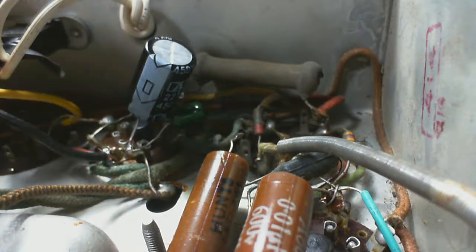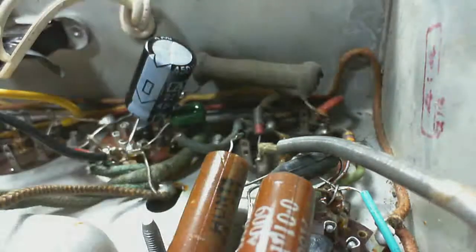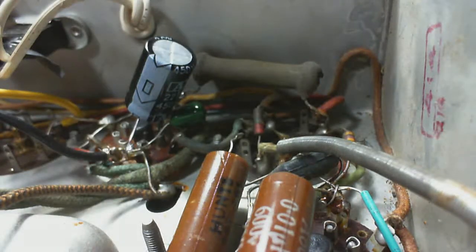Back in the day when these ones were being put in, these molded capacitors, the person putting them in, their mind for sure, was, I'm getting rid of these old, tired, probably paper capacitors, and I'm putting in these great molded ones, the latest thing. And it's turned out in the long run, these molded capacitors are unreliable. So, should I change all those? I don't think so. I don't think there's any reason for me to do that at this point, unless we detect the problem with the way the radio's operating.